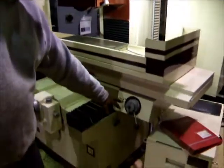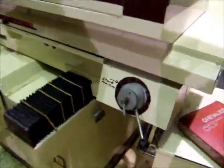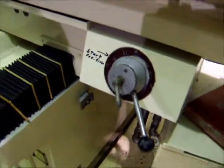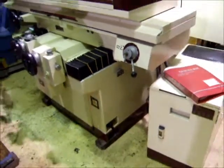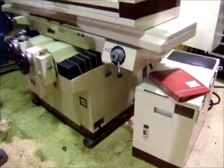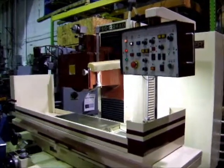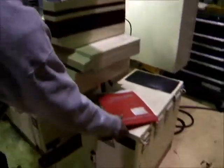Also, the machine will not start unless you've got the hydraulic control lever over to the manual position, for safety reasons. So if the pump doesn't start, you can make sure you've got the lever in the right position. It comes with the parts and operations manual.